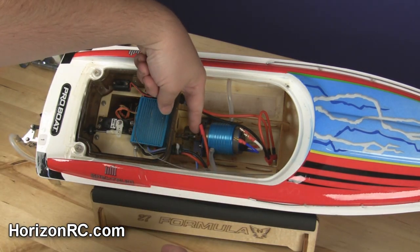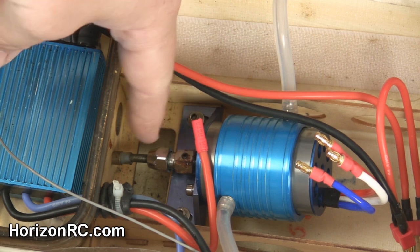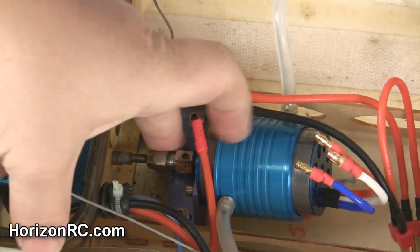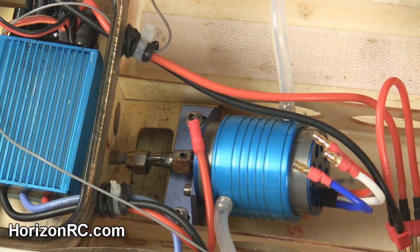What I'm interested in is this part right here. What you'll need to do is loosen up the collet that retains the flex shaft and connects it to the motor. This part here is stationary, closest to the motor. This is the part you'll have to loosen up. I've already done that, and as you can see it just slides right out of place. You can see there's a groove here — that's where the collet keeps everything together.